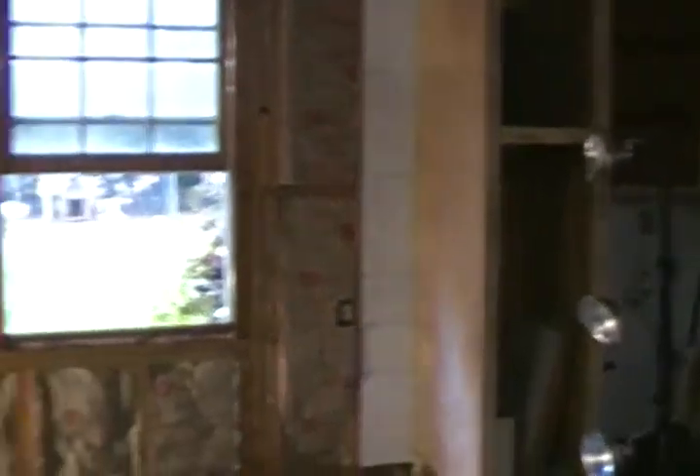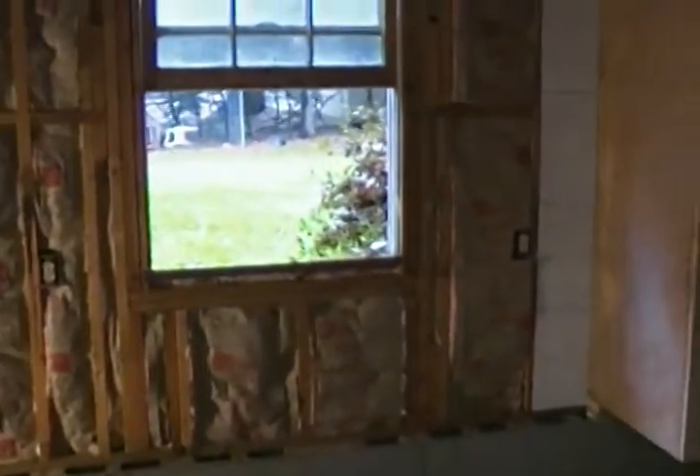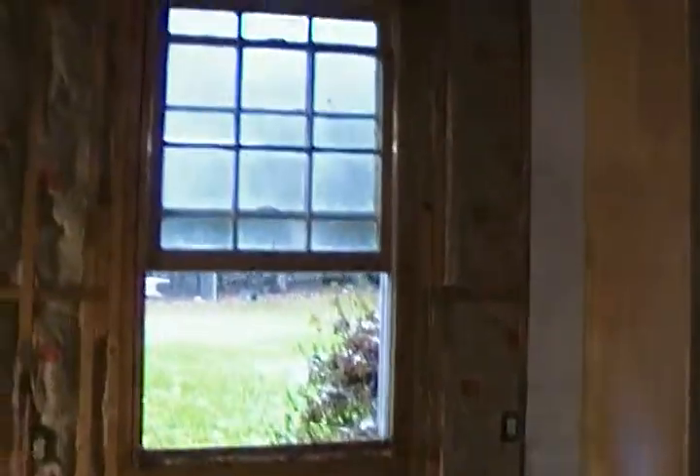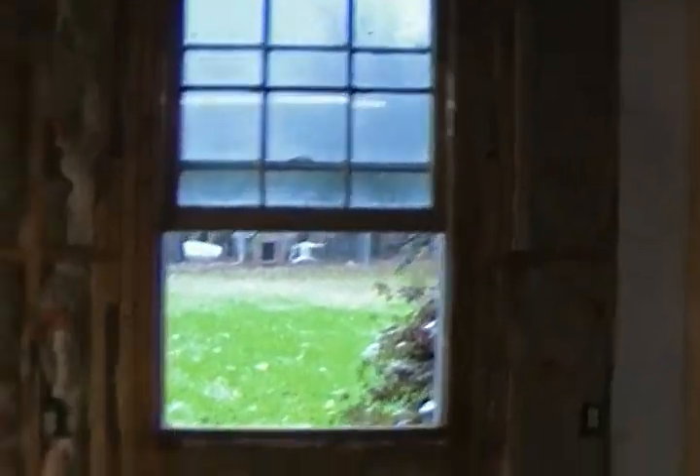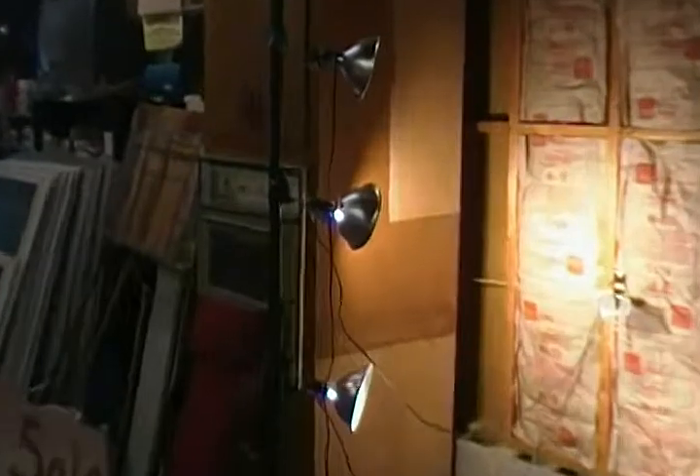What we've done is continued down this wall here after putting our cabinets and stuff. We finished clearing this area out yesterday — had to move a weight bench and an old china cabinet. We took our bars down off the window temporarily, and got all our insulation installed yesterday about midway down this wall. Today we'll be putting up some OSB and moving this cabinet over here with the stove in it, getting it mounted in this area.